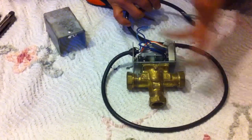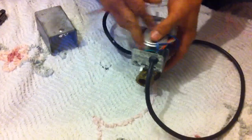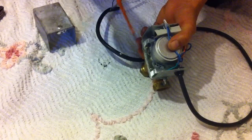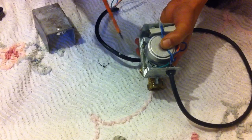Assuming it's working and everything's moving as it should be, what you can do is look at changing the head or taking the head off. Diagonally opposite, you've got one screw here and one screw here. Now, if you've got four screws — one, two, three and four — you've got a problem, because you've got the old-style Honeywell valve.